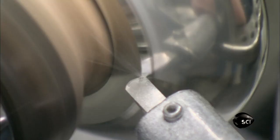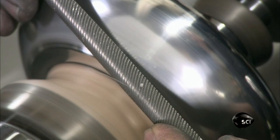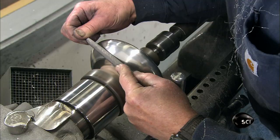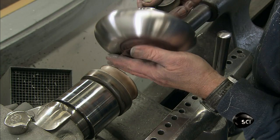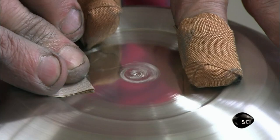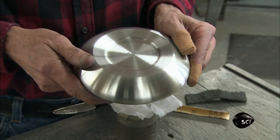With the soldering complete, he trims the excess from the base of the lamp. He files the seam smooth, then sands the seam and the rest of the oil lamp reservoir to a satin sheen. Another member of the team sands the base up to the maker's mark, just in case anyone turns the lamp over to check it out.